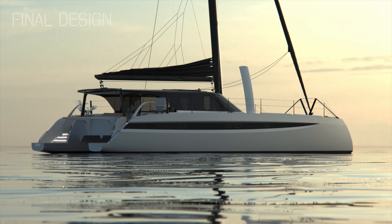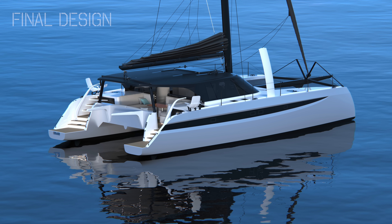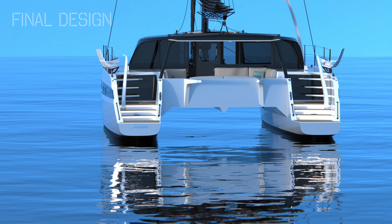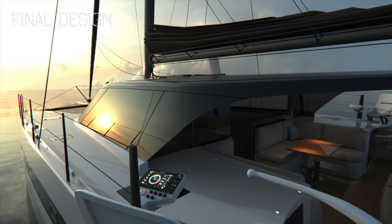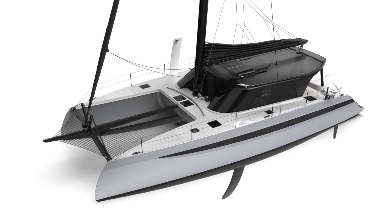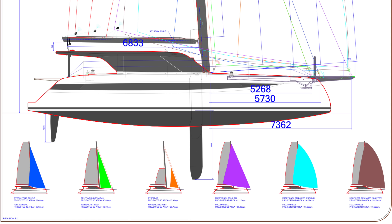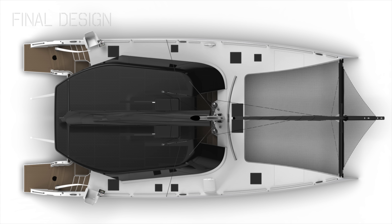You've got eco drive, electrification, solar, great airflow, and the boat is lighter too — we expect the structure to come out a little bit lighter than the 50 because we don't have all this mass up top. It's a little bit simpler construction of the cabin top. That lowers the boom, giving more mainsail area. We extended the mast, lowered the boom, extended the gooseneck — more horsepower for sure. Moving the boom lower lowers that center of effort, so you don't have quite as much stress on the rig up high, which gives a little more power with a little less heel angle.